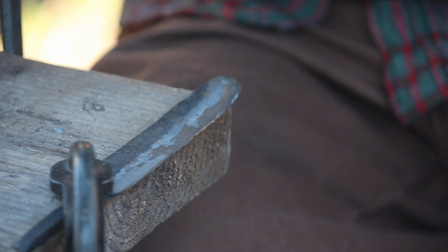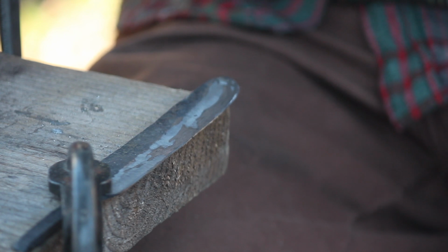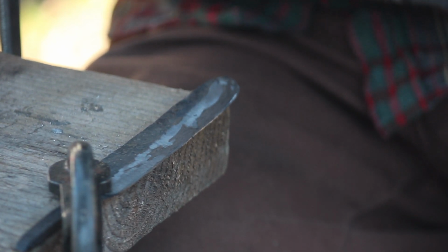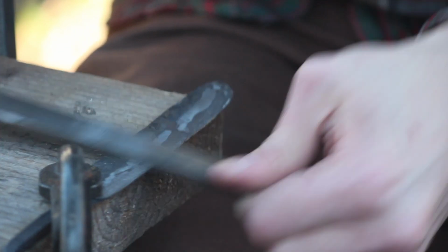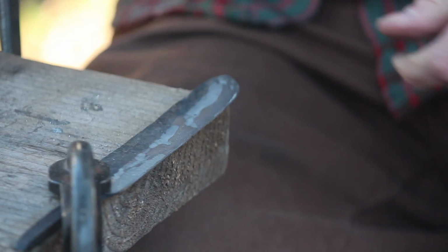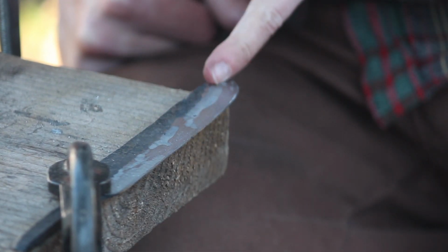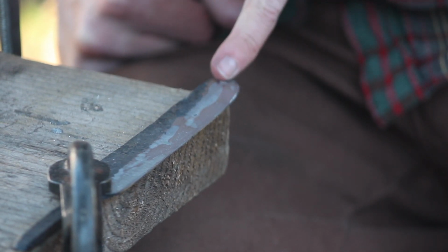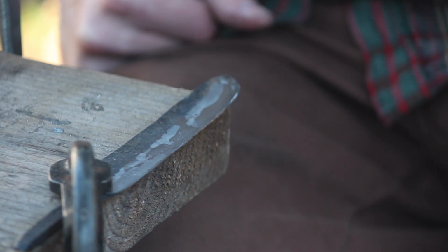It's an interesting process, and then this kind of work will also make the final polish on a grinder like the WorkSharp a little bit easier, so it's not a complete waste of time. But you can see, if you want to try and get this completely homogeneous, you've got this real deep groove right here. Like, it doesn't look that deep, but to try and take off all of that steel in here to even that up, that's a lot of work with just a file.